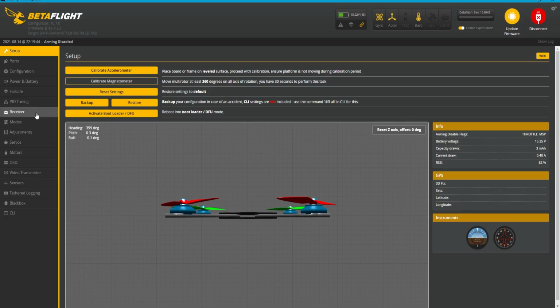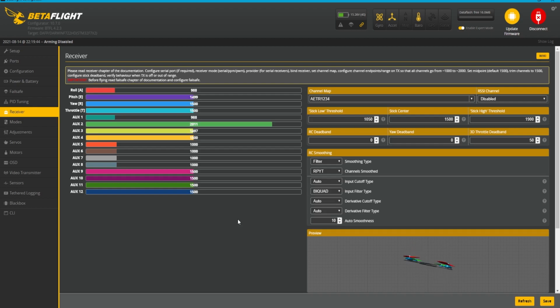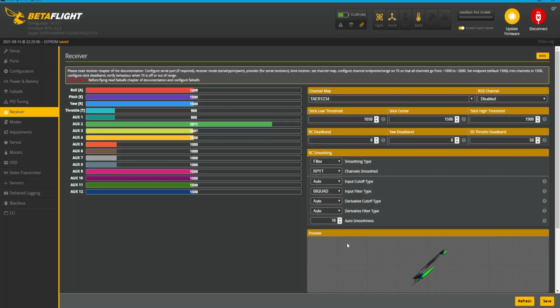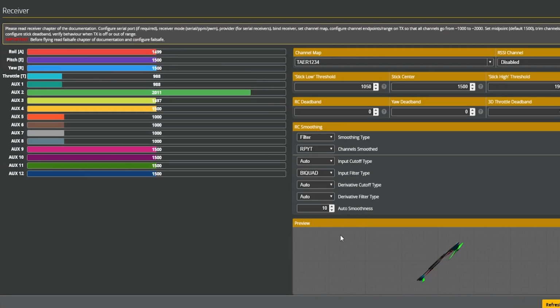Now you can head over to receiver, and as you'll see, all of my controls are working. My quad is freaking out, and that's because my channel mapping's wrong, so I'll go ahead and change that. Alright, so there you go. If I spin my yaw, pitch, roll, throttle, everything's all good. I've even got switches working already. Look at that. Nice and magical. Turtle mode. Yep. Turtle mode's on and working.